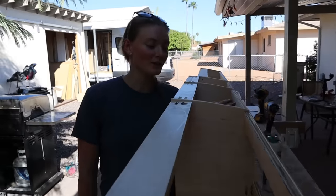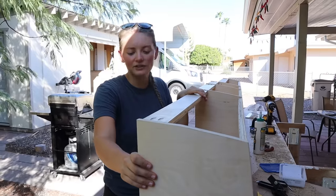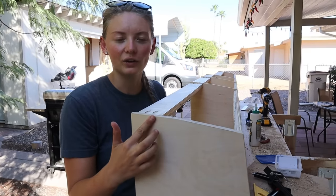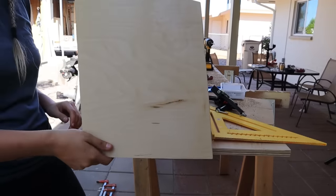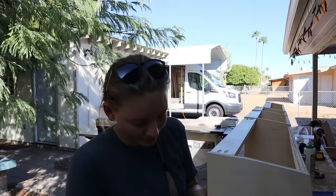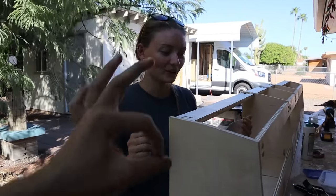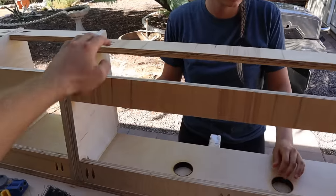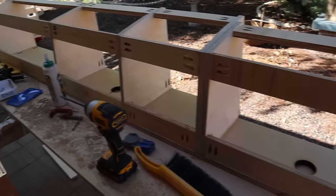The reason we opt for pocket screws is to avoid putting screws coming from the outside in, because it's just more things that you would have to fill and sand on the outside. And sometimes over time in a van, things that you fill can wiggle their way out and crack. So we actually have no holes on the outside of this whatsoever. The bottom piece is a single piece of plywood and we just have our end pieces — we were completely able to avoid any screw holes on the outside. A lot of the structure behind the cabinet is pocket jig behind the actual structure, so when you open the cabinet, you're not even going to see most of the supports.